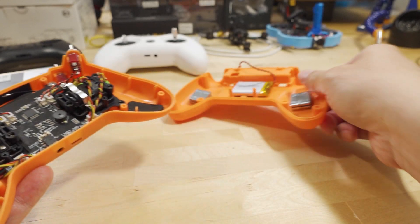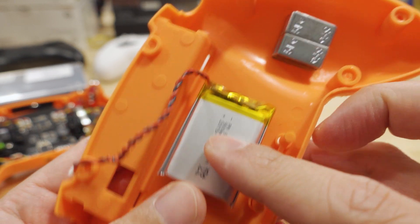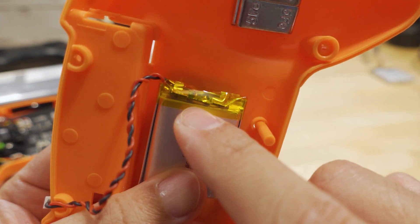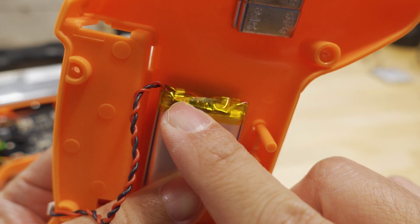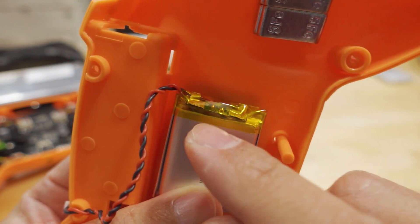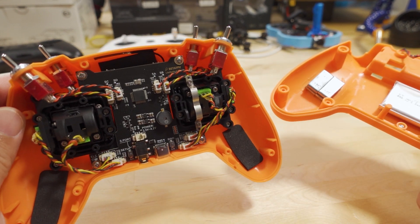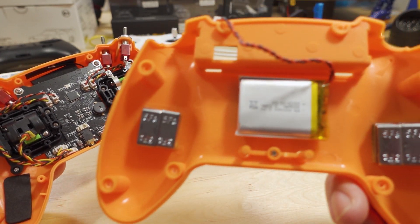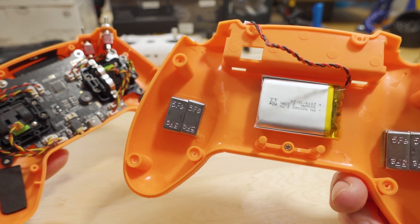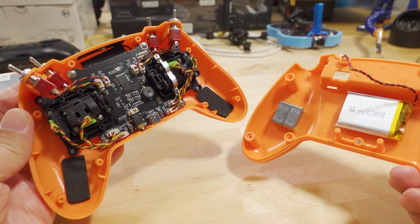Plug in the battery and stick it to the back. If you're doing the conversion from the micro USB version, make sure whatever 1S battery you use has an over-voltage protection circuit — not all 1S batteries have this. You want to make sure it's there because the charging circuit on this board is a simple one, and without over-voltage protection it won't stop the charger from overcharging the battery, which is a safety concern.